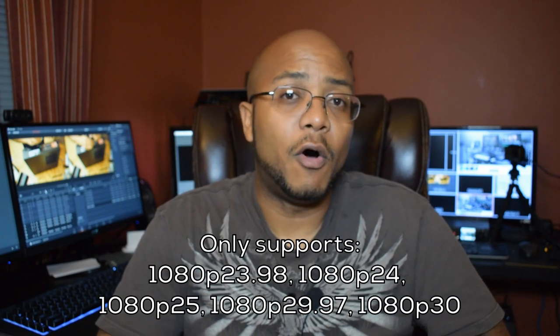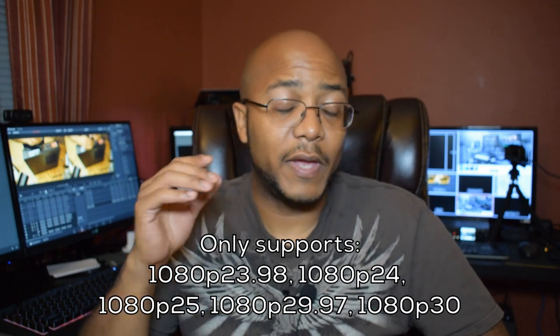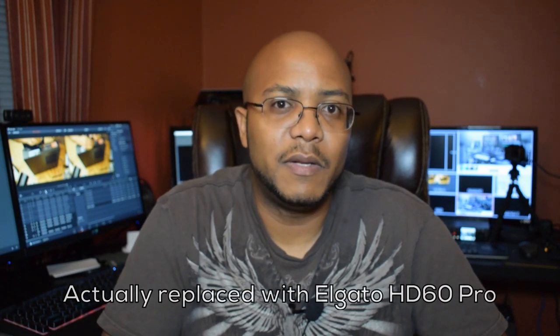59.94, which the Decklink Mini Recorder cannot accept. It can only accept 1080i 59.94, and it doesn't do 1080p at all. You could get the 4K version of the Decklink recorder, and it can handle that resolution. Not really that big of a deal. I might think about getting one of those, but I'm not really that hard pressed about it.